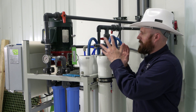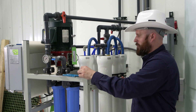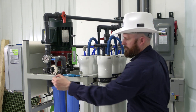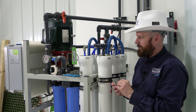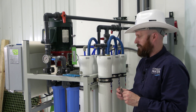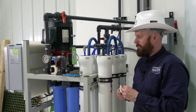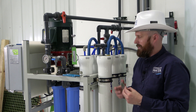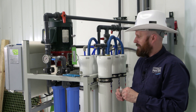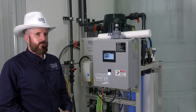That's pretty much the process for replacing the RO elements. Remove your T-handle, thread back in your tube, get your end cap down the rest of the way, and reinstall the backing plates using that 3/16 T-handle Allen wrench. I do not recommend using an impact wrench — some people have done that and you can crack things, potentially strip hardware, or over-tighten and make it very difficult.